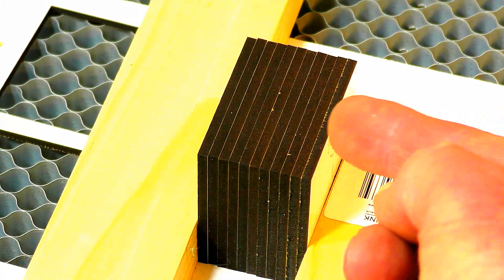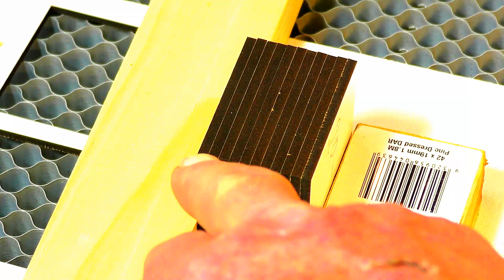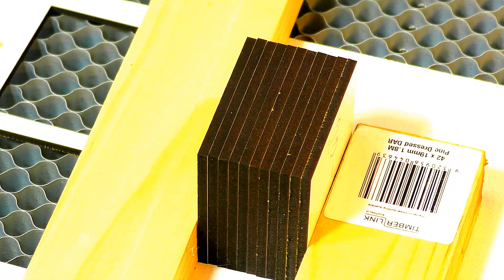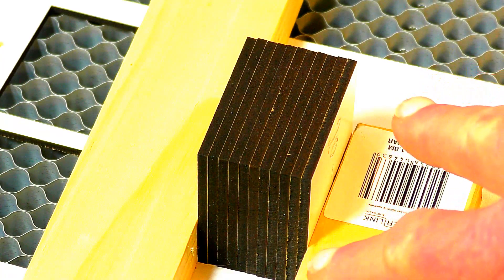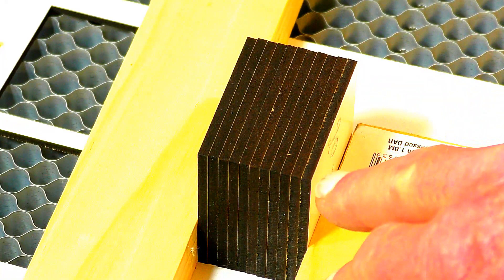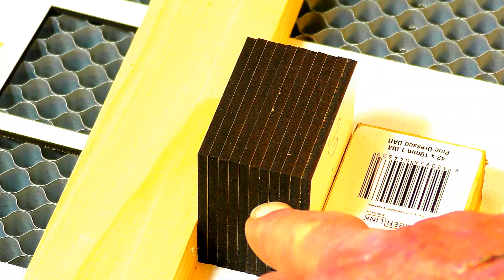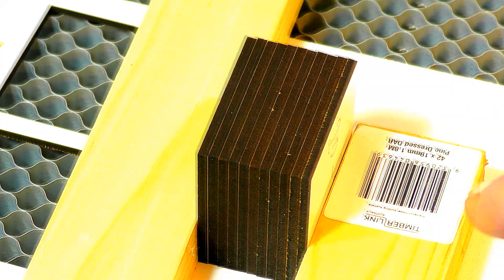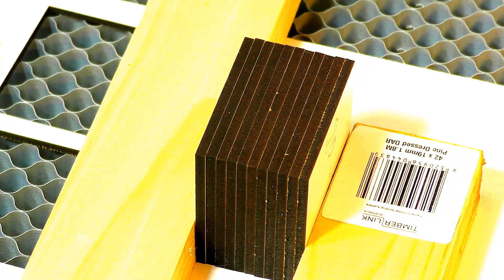It goes darker in that direction. So the idea is you get the lightest cut in the material — with MDF you can tell a bit by eye. You want the lightest color you can get while still fully cutting through. About 18mm would probably be the perfect cut for this material. In the next video, we are going to do a similar process with some plywood of different types, and the effect on that is more dramatic.